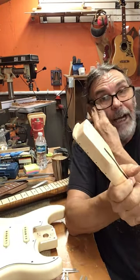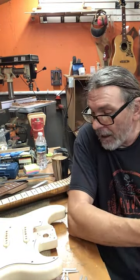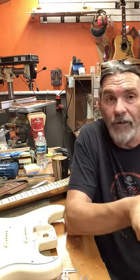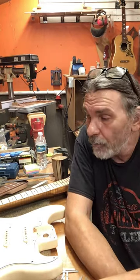This one may only need about an eighth of an inch off the back. Some people say, why don't you just take it out of the neck pocket? Some guitars you can, some guitars you can't. It depends on where the position of that first pickup is and if it's a single coil or a humbucking pickup.